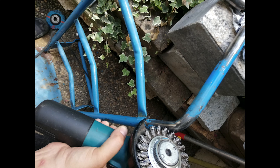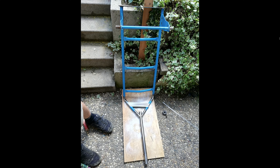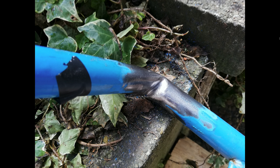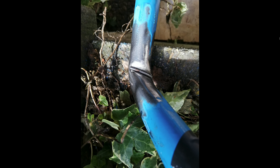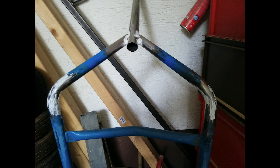I cleaned up the new pipe and the whole truck for welding. I also made a fixture so it doesn't move during welding. Then I welded it together — it's not perfect on these parts. For example on this side there was a gap caused by bending, and the other bending fixture was too nearby. To fix that I put in a nail and welded it up so I can sand it later.